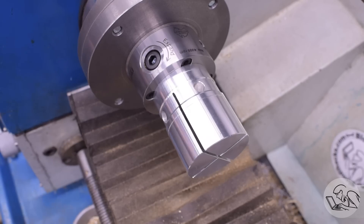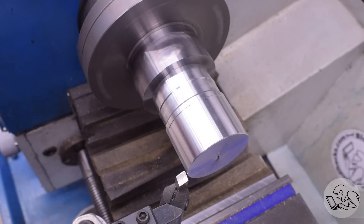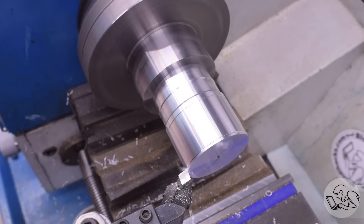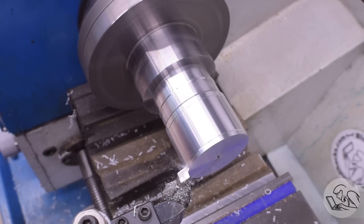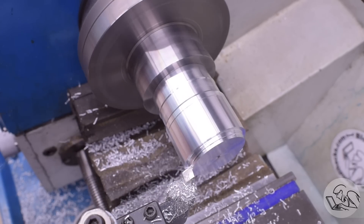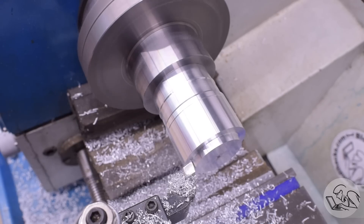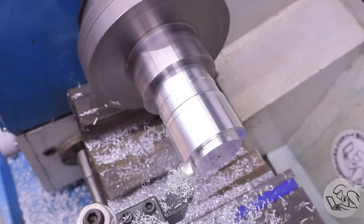Let's give this thing a whirl. I have this thin-walled brass part that I'd like to try holding in the Flexi-Chuck, so step one is to machine this boss down to a size that will hold it. The instructions specify that you expand the block by a quarter turn on the chuck before machining, which holds everything tight and also ensures that when you machine this down to a slip fit on your part, the piece will be released when you collapse it. This is a flexure after all, so there is going to be some variability in the spring back, and machining it to size slightly expanded guarantees it will be smaller than that when unexpanded.